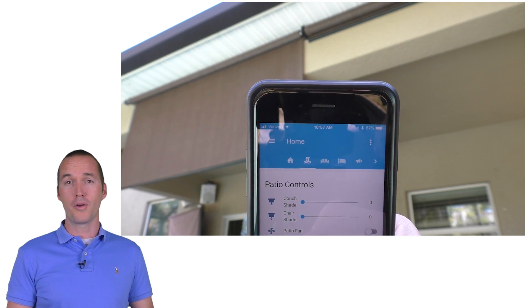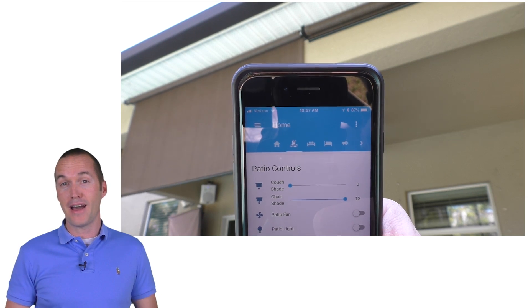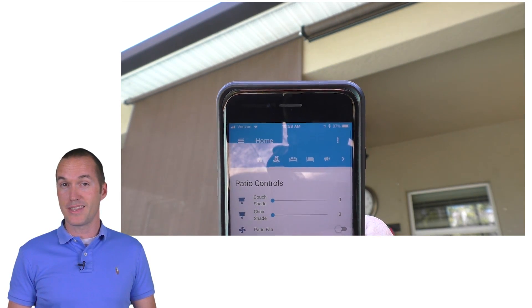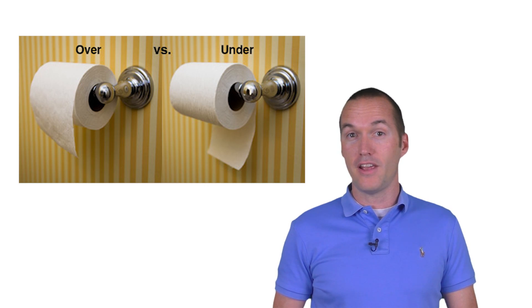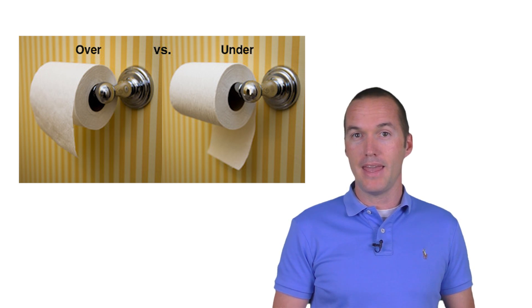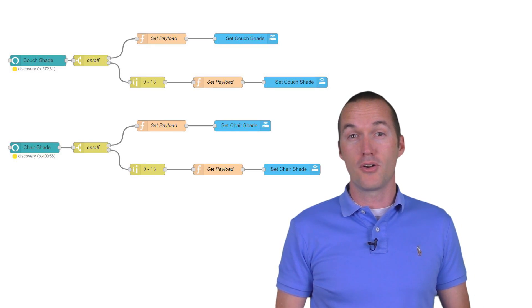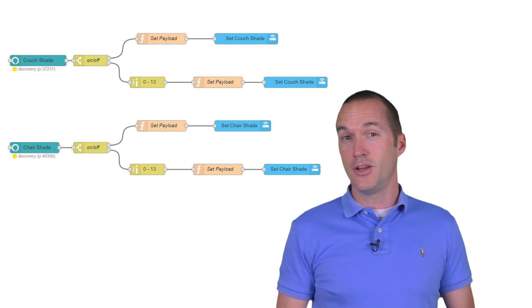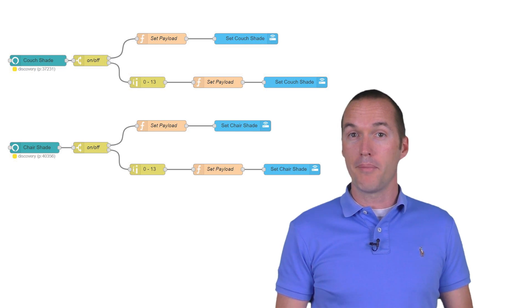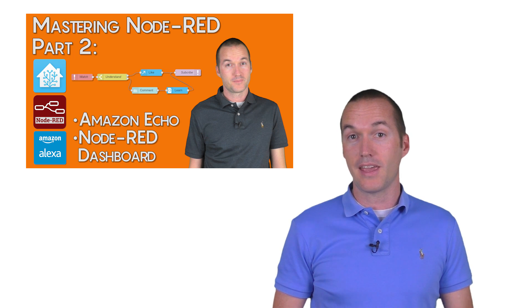If the values ever get uncalibrated, all you need to do is send an MQTT value of 13 or whatever your max is, and after the shade is done moving, manually pull it down to its maximum value. If everything went according to plan, you should be able to control your shades with Home Assistant. The code doesn't get confused if you send a new value before the old one has finished processing. If your shades are rolling up the wrong way, just reverse the positive and negative wires for each of the A and B motor pairs in your driver. I also have my shades set up with Amazon Echo using Node-RED and the Alexa Local Node — I'll post my Node-RED flows in the description.